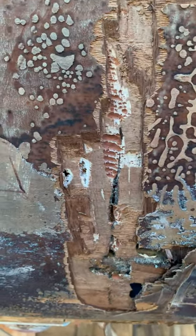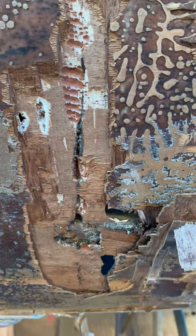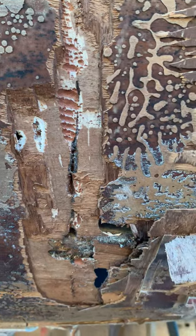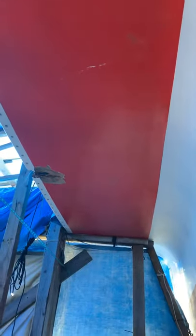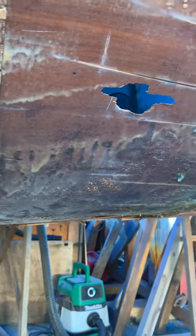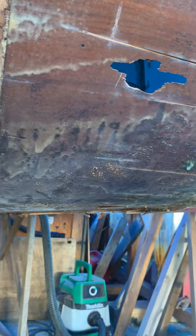This crevice, filthy nastiness here, is what happens when you have loosely fitting bulkheads that are coved in a very sloppy and haphazard manner. This is a water passage that's bringing rainwater all the way up there and from all the way forward of this roof, nursing it down here into the bilge in a very inconvenient area to inspect, underneath the cockpit, with about 2 millimeters of head clearance for a baby, and down underneath the keel joint, underneath the floor, underneath the frames.